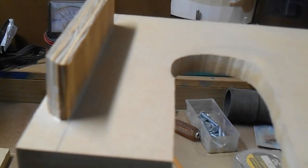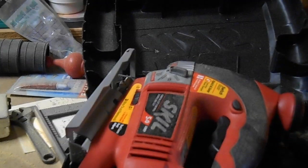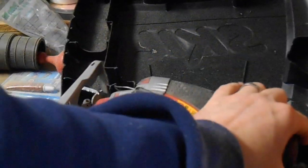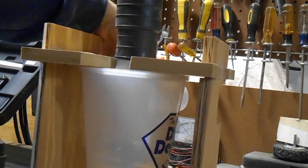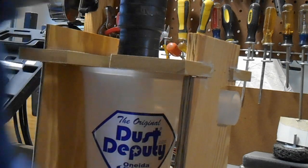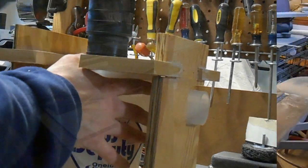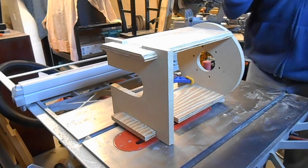I'm doing most of the cuts with the jigsaw. I've now widened that out a bit — you can see it's kind of uneven. This is the reason why it would have been nice if I could have got this right the first time before it was all assembled. But again, prototype. I'm using the jigsaw in scrolling mode so I can pivot the head around. I'll try to clean that up with a drum sander. It also makes a hell of a lot of dust. I really, really hate MDF.